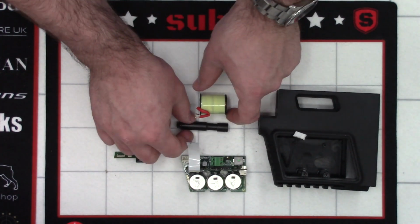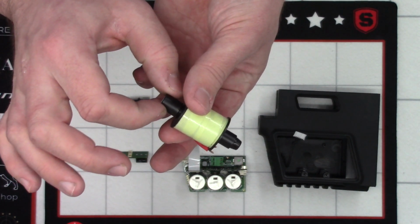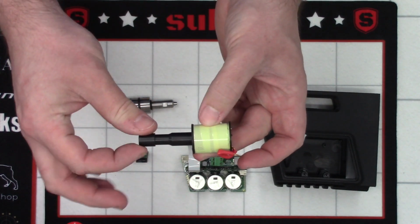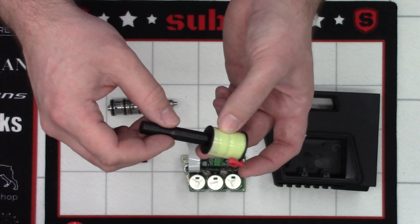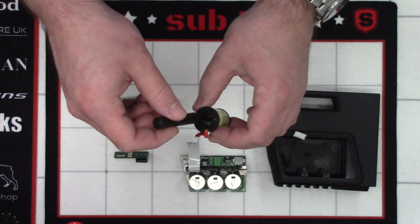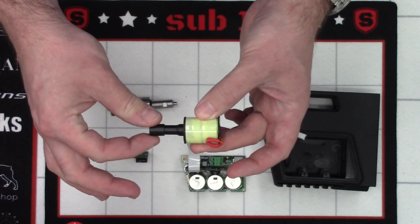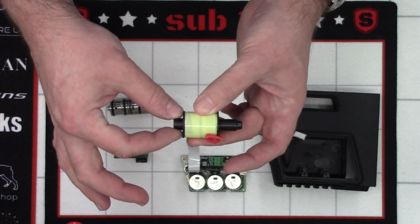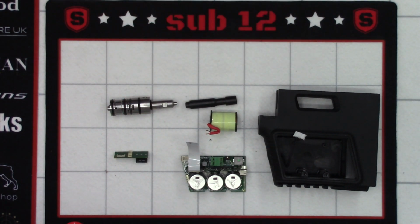We also don't have to worry about how exactly the hammer goes up the middle or the hammer tube. So in this setup, the hammer is a fairly loose fit in the coil itself, but because of the way the coil actually works, the hammer will always be pulled up the exact centre of the coil. It's being pulled by each and every direction, so up, down, left, right, in exactly the same way. So what it does is it effectively floats in the middle. There should, in a system like this, be no friction or touching of the hammer in the sides there. There may be some, as the hammer hits. The force will obviously cause the hammer to slightly ricochet, but that's normal and shouldn't affect the way the rifle shoots. So the hammer is pulled up the exact center of the coil itself, and so we don't have to worry about friction or any inconsistencies caused by that.